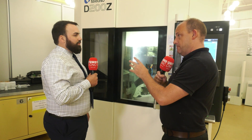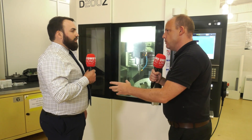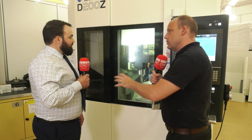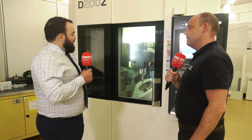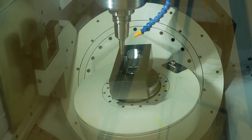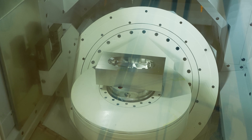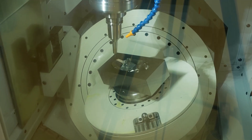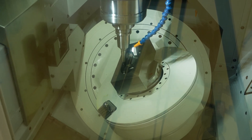It achieves this because of the build quality, and there are a couple of other points — the cooling. There's no heat in this machine anywhere. The ball screws, the spindle, the motors, the casings, the castings — all of it is cooled, so the part is always at a consistent temperature, and so is the machine. It's a very stable machine. You've got jacket cooling and core cooling around the spindle. The machine has 30,000 RPM, and all of that keeps the spindle growth to a minimum, with the ball screws and motors all cooled as well.